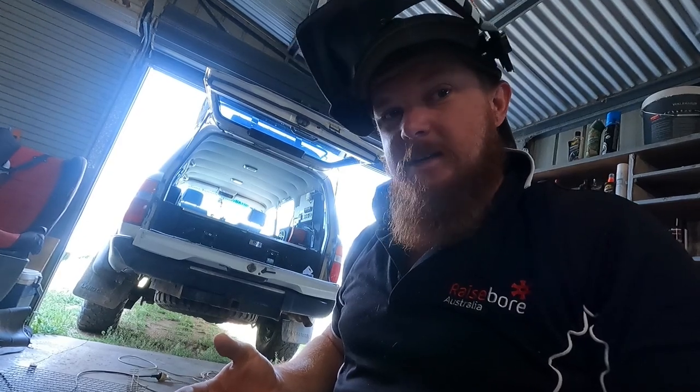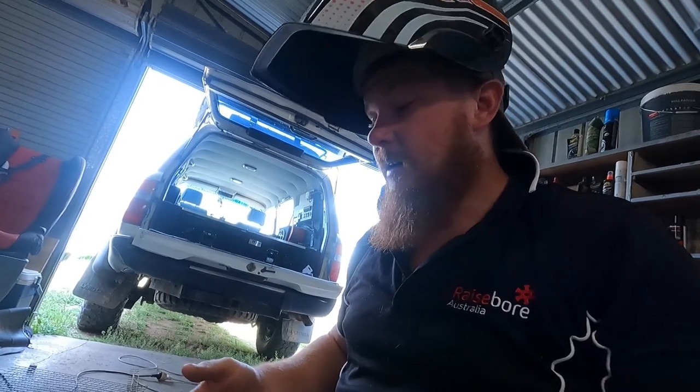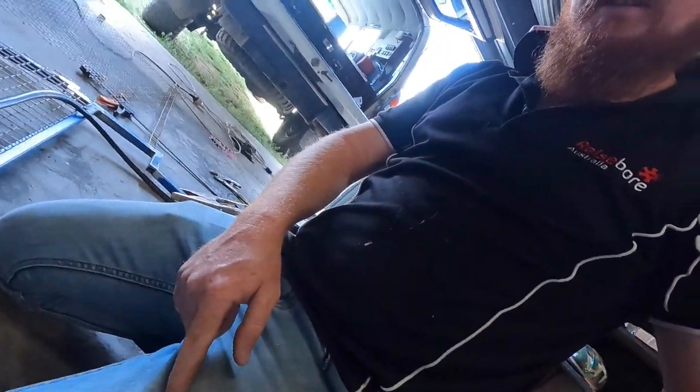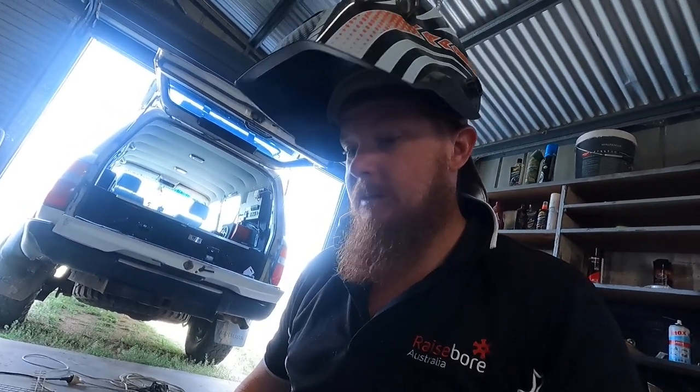Now yesterday you might have seen me welding with shorts on. Done it before and I've had the same outcome. Don't do it. Welding causes weld burn, it's like sunburn. When you're wearing shorts and you're welding down there, where's the light going up? It hurts. Wear jeans, at least long pants. Yeah, if you've done it, you know what I'm talking about. It's not pleasant to be sunburnt there. So yeah, wear jeans, look after your bits.